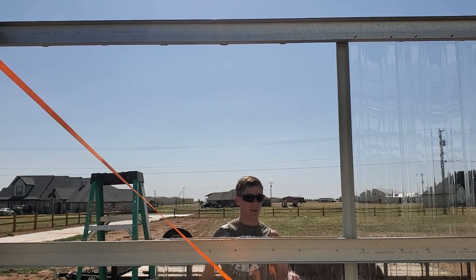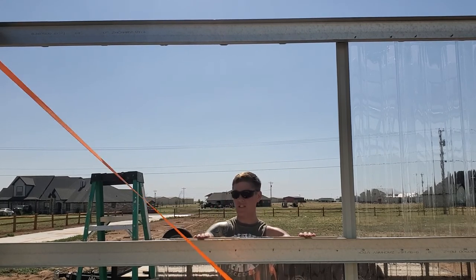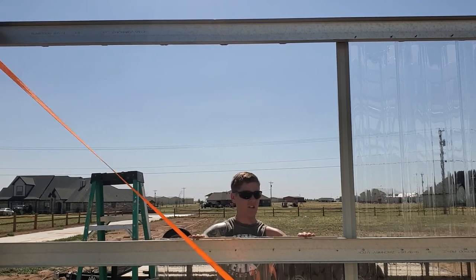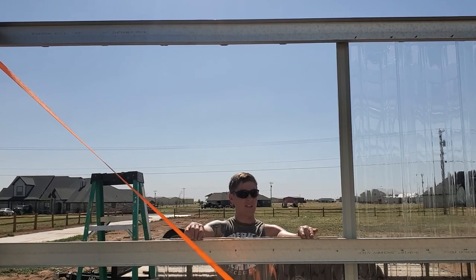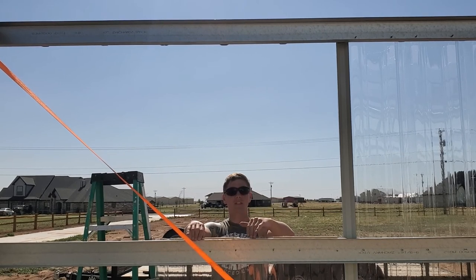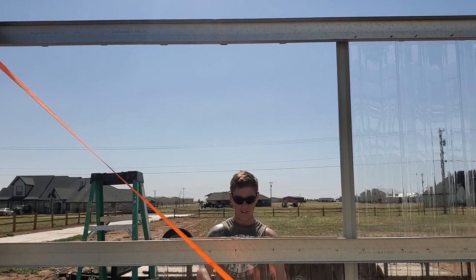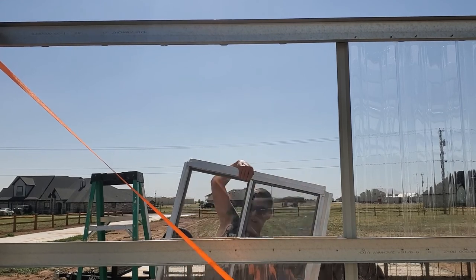But what I'm doing to start is on where this window sets, which it sets on the skirt right here. I put a stack of two paint sticks here and a stack of two paint sticks here, kind of act as shims and shimming up off this skirt just a little bit. I did that because the window's not quite tall enough, and if I don't have these in place, there's nothing up top to screw into. So I'm shifting it up just a little bit in order to help me get this top lip of this window screwed in. So I'm gonna go ahead and...